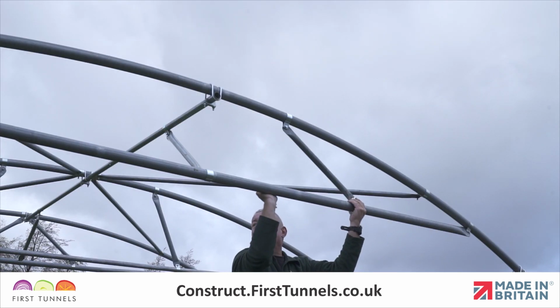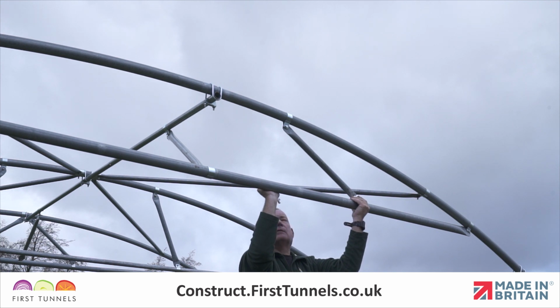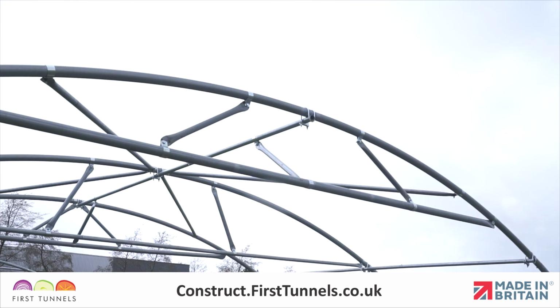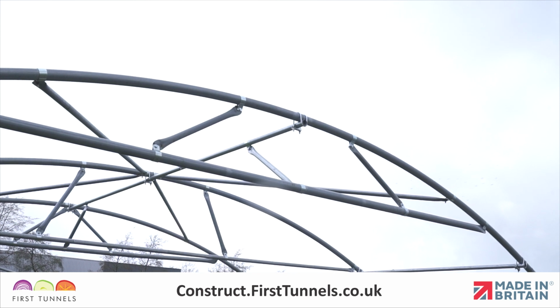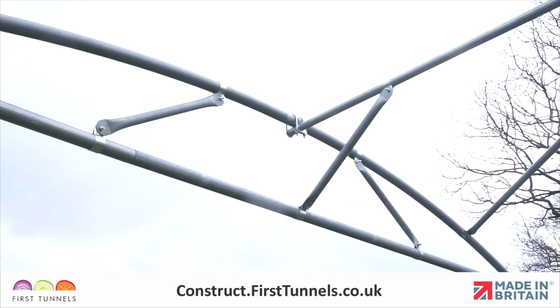Ensure that the door rail vertical braces are not pushing the door rail down nor pulling it up. Once you are happy with the level, tighten both Q-clips. Repeat this on the other side. Repeat this process to fit the door rail on the opposite end of your polytunnel.